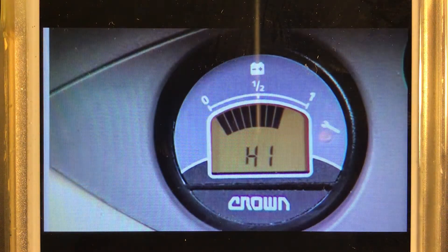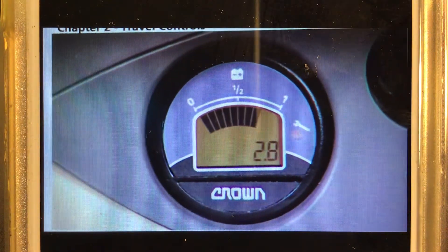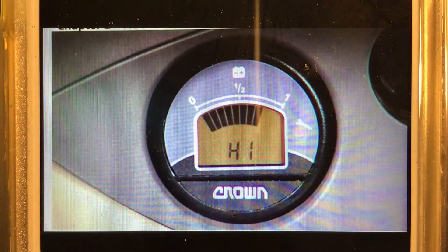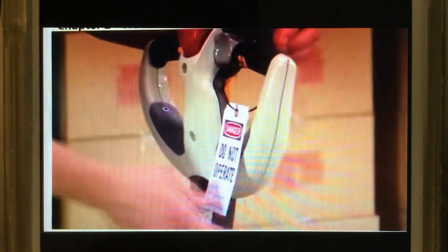Some trucks may be equipped with a battery discharge meter or an hour meter. These should light up and show battery charge level when the truck is turned on. If the wrench light stays on, do not use the truck. Report the problem to your supervisor and lock out and tag out the truck according to your company's policy.